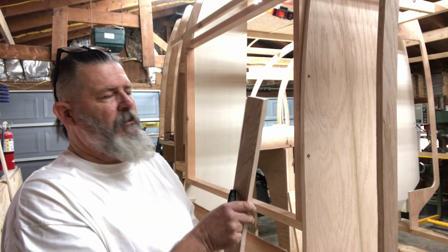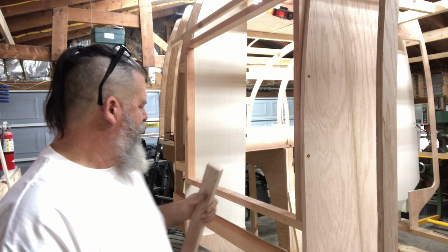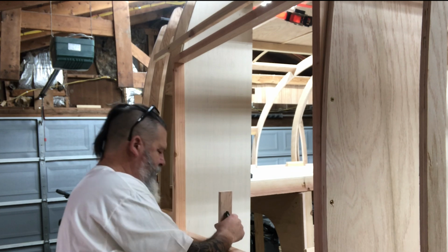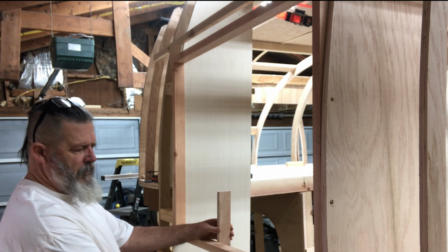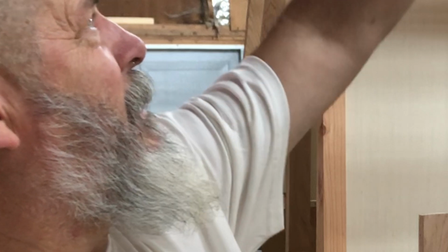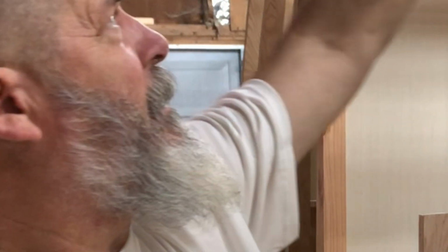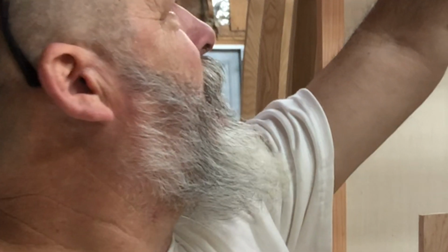These supports were actually pieces of the open ribs. They're gonna go 1 foot on center on this side, and they'll connect just below or to the underside of the piece that I'm going to support this frame with. But what I'll probably do is across the top of the roof beams, the beams that basically carry the load across the roof, I'll put another board on the outside of that just to strengthen it a little bit more.